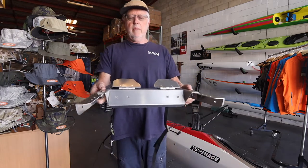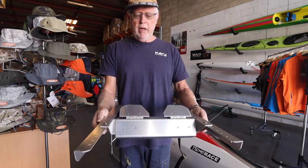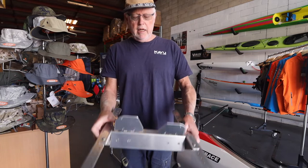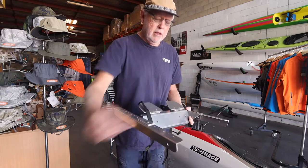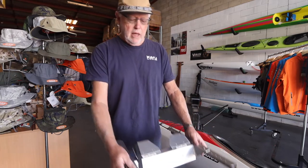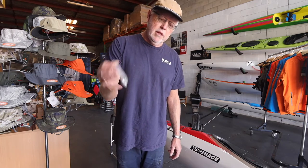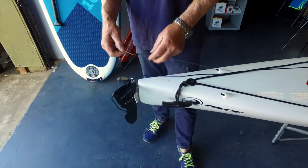That's how your system will look inside the boat — there'll be a little bit of angle on these brackets which is built into the system for the taper of the sides of the boat. You'll notice that these foot pedals are sprung from behind with a simple piece of shock cord, and they are infinitely adjustable on these nylon webbing straps which attach directly to the rudder cables. The only other parts you need to install this into an existing kayak are the screws, washers, and nuts that attach to the side of your boat. In some cases you may choose to change the existing cabling.